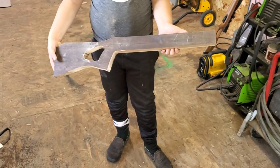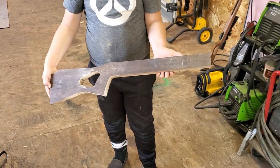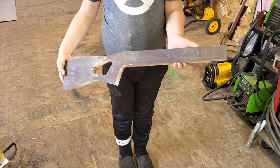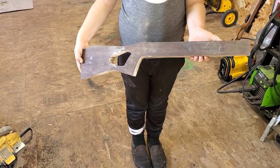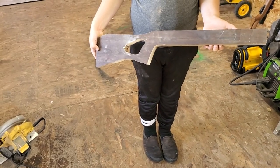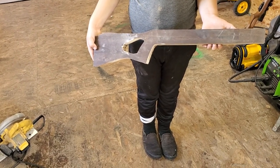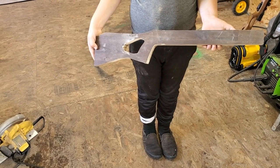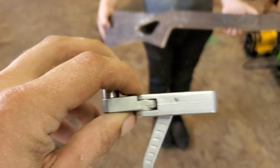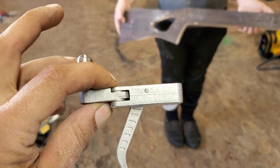We've now got the initial frame cut out — it's a pretty close match to the 22 pellet gun. We still need to build the Y for the end of it and account for that distance. We're going to start shaping this into something a lot more comfortable in the hand, but first we're going to drill out for the trigger so I know the distances and don't over-sand areas I shouldn't. We'll get set up on the drill press, drill out the center, and use a chisel to have it countersunk in there.